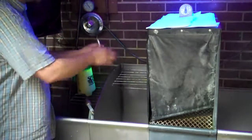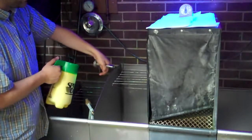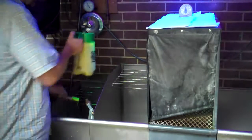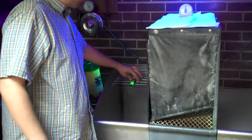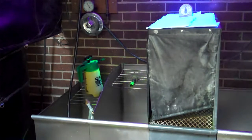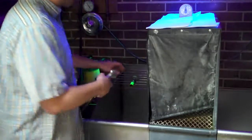I've already pre-cleaned it, it looks good. Really all I care about anyways is this part over here past my hands. I'm just going to apply my penetrant, just spraying it on — it's been pre-cleaned. I've dipped, brushed, or sprayed it on — however you want to say it, it doesn't really make a difference. I've got my dwell time specified by whatever company you're working for. We're using 1417, and it generally says 10 minutes is acceptable.